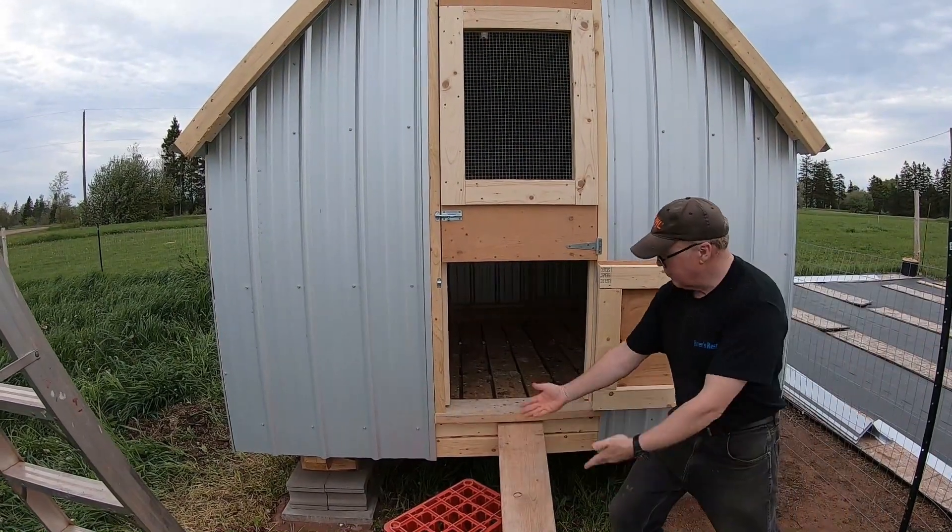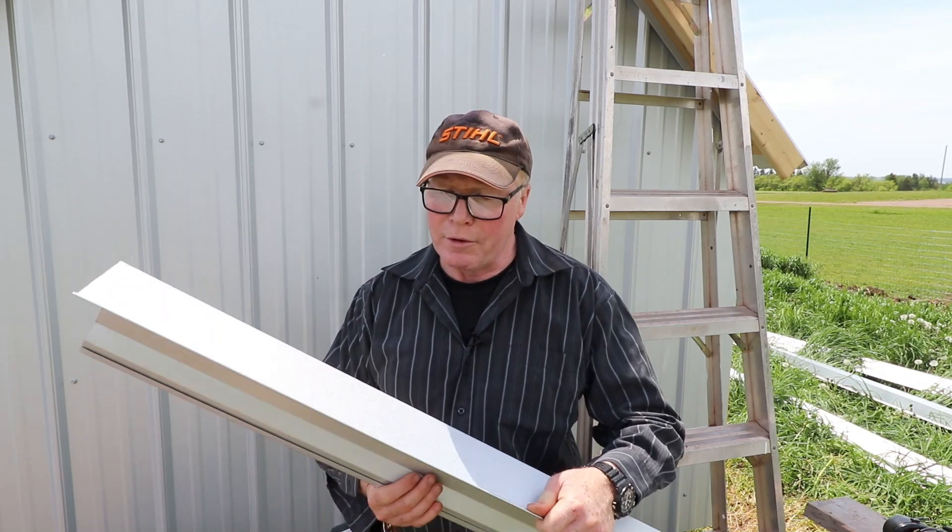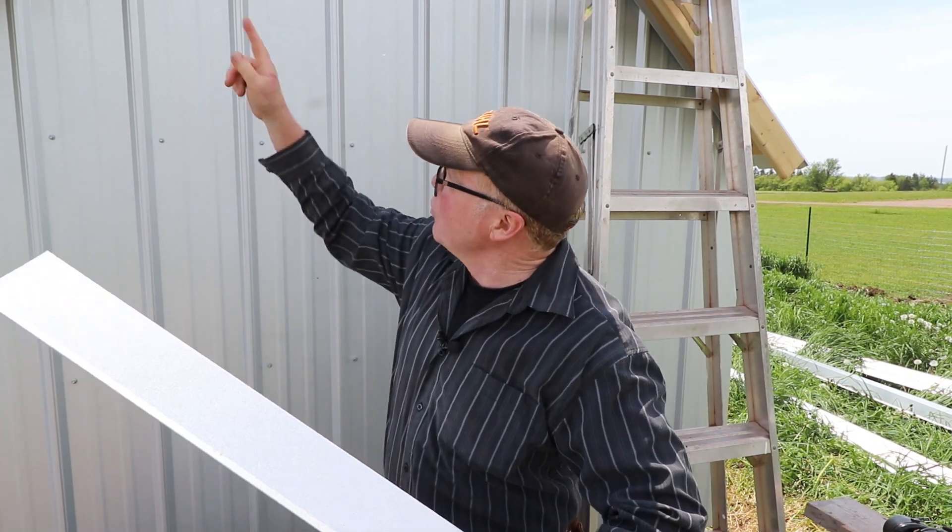It's another day and another project. Rovers, it's a beautiful day, a little bit breezy, but I'm going to get caught up on some of the details I wasn't able to do when we were getting the hen house ready. The hens are perfectly safe — perfectly free from predation and free from the weather — but the house itself needs some flashing. What I'm going to work on first is the eave flashing. This is what prevents the weather and snow from getting under the roof and causing damage to the building.